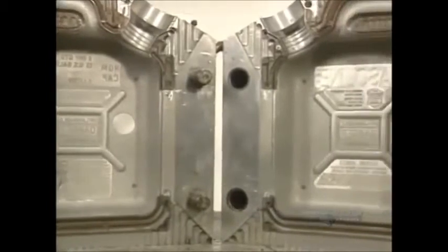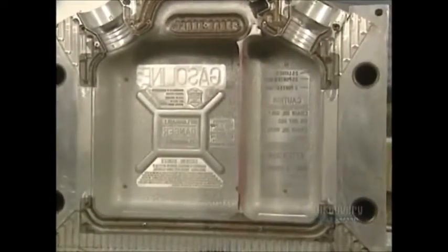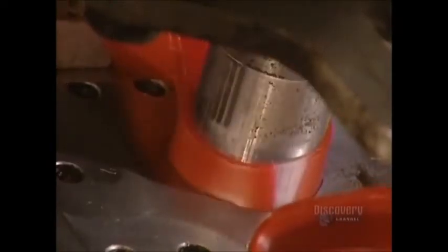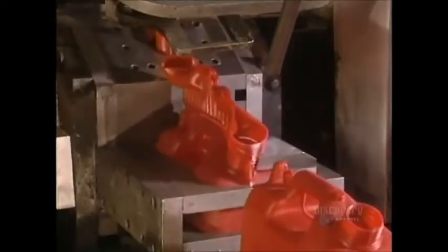The melted plastic will be blown in and will take shape within this mold made of very high-quality, dense aluminum called aviation type. Blow molding continues and produces a soft plastic tube. This is cut and placed in the mold. Then this nozzle pumps the plastic into the mold shell. The container is unmolded and moves along on a conveyor.